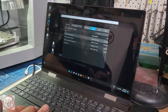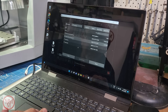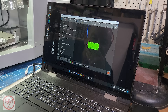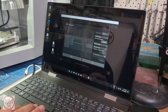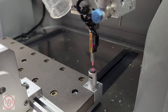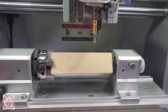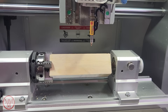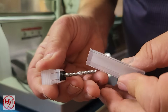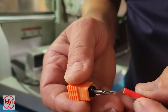I haven't shown this yet — it's the probe. Every time you do a cut you have to start by probing the area. It checks there's clearance for the tool to do its job and also registers the height of the material. There's an option for multiple probes if you're using a sheet of material that's uneven — useful because machining uneven objects increases the risk of breaking bits. Here's a preview of the bits I'm going to use: one has an arrowhead tip, the other is a fluted spiral cutter.